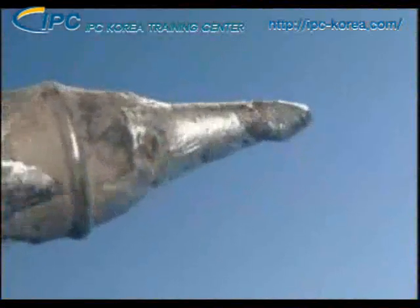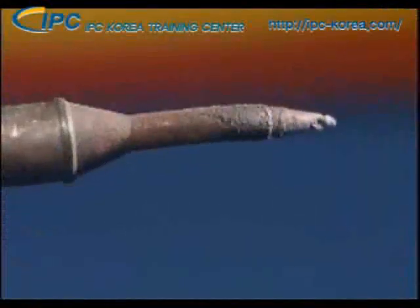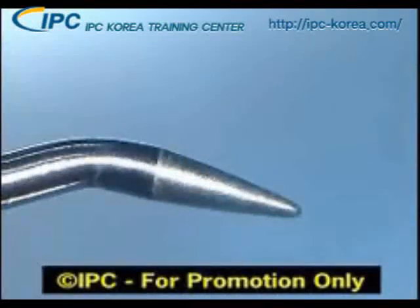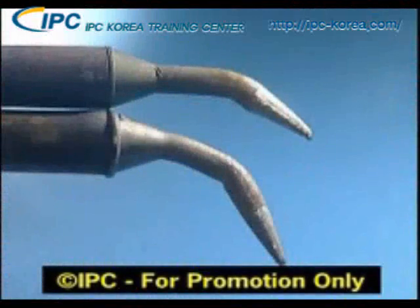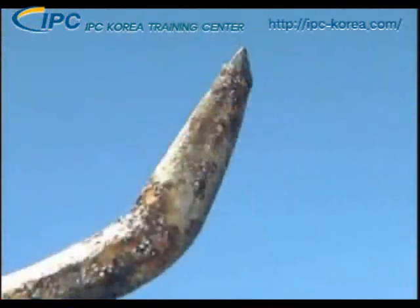Here are some examples of tips that have been deformed from too much pressure. Notice that this typically happens with conical or pointed tips. Very fine surface mount tips are particularly susceptible. Bending the tips will eventually cause the plating to develop micro cracks or fissures. Once a fissure is created in the tip surface, the copper core is exposed to moisture, oxygen, and tin. This mechanical damage will speed up the erosion of the copper, and the tip will no longer be usable.